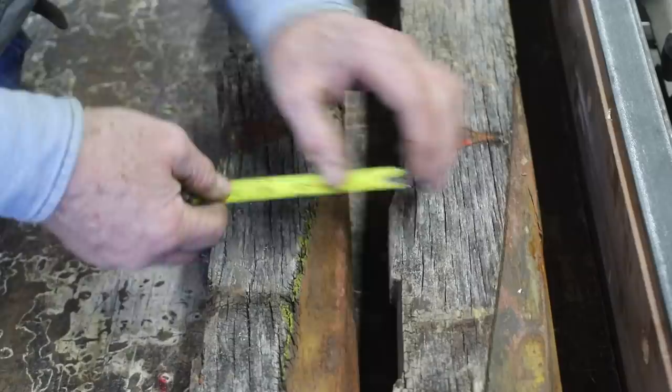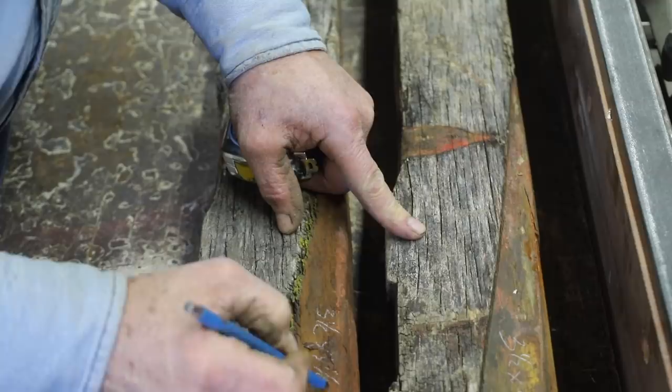So even though we're not using a regular axle gauge and steel axles that we can press through the press to put them in position, the measurements are the same. It's how we get to the end is a little bit different. On a wood axle, these have to be carved into position. For a steel axle, they can be pressed.